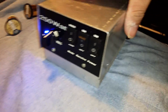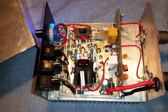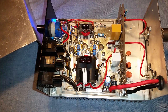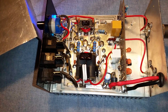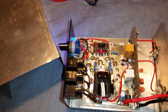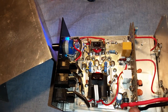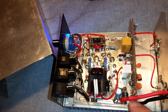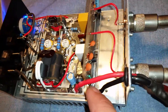Preamp works just fine. Here's what we're working inside. I went ahead and cleaned her up really well, cleaned all the flux out of her like I usually do with amps that I repair like this. Basically, somebody had hooked this amplifier up backwards and it had completely blown the ground portion right over here in this area off the board. So I went ahead and repaired that ground portion there.